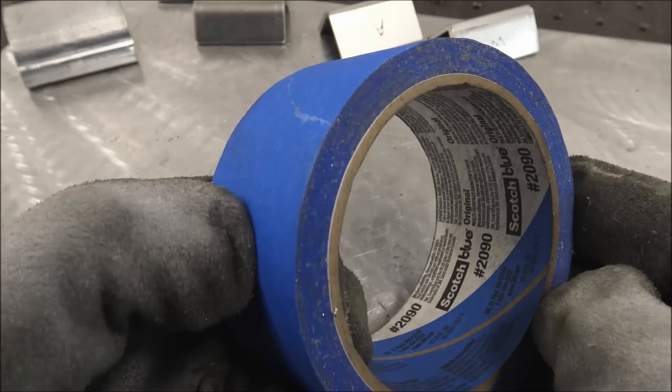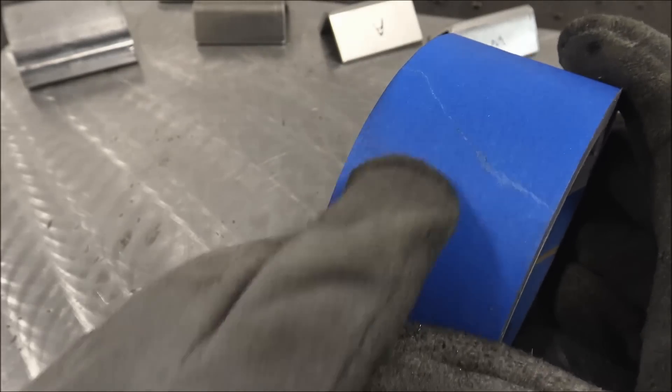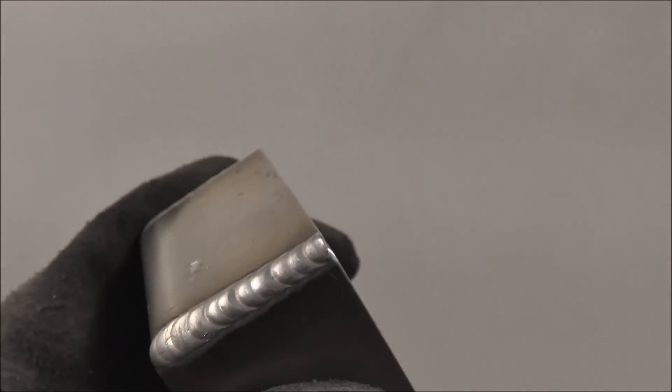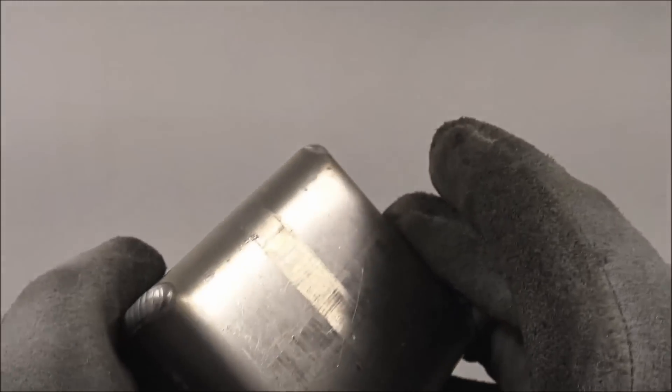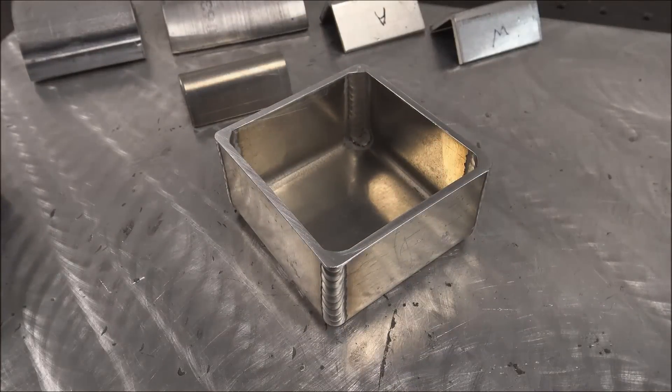I didn't really care about scratches in this video because it's just a demonstration, but if you don't want to scratch your parts you can put painter's tape on them so the port-a-band fence doesn't scratch everything up, then just peel it off after — this stuff doesn't really leave much residue. See how much cleaner those tops look if you trim the weld stop off? A lot more professional looking. Thanks for watching — if you have any more comments about stuff you think I'm doing wrong or that needs clarification, let me know and I can make a video on it. See you next time.